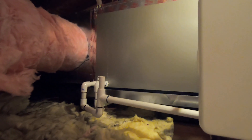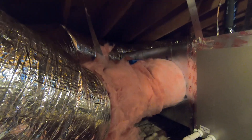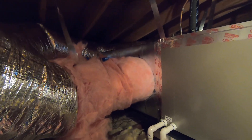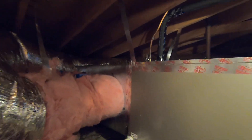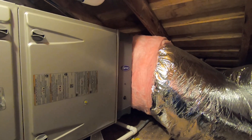To do this we had to do all new ductwork. You can see we enlarged this return duct, which was a lot smaller before, and we actually added a return duct in the master bedroom right behind me — this high ceiling — so we cut a return duct right there. There's a lot going on in this attic because it's very tiny, but we have the evaporator coil, the drain lines we ran out, and a two-inch PVC flue vent for the furnace. Ductwork runs all over this attic off the back side. We had to make sure each zone had enough air — the minimum for one zone is about one ton, which is 500 CFM. The downstairs zone gets around 1000 CFM. We calc everything out to make sure every zone gets the proper airflow for cooling and heating.